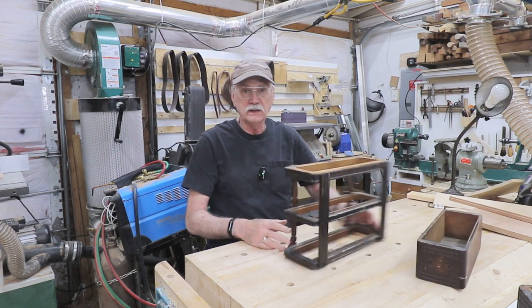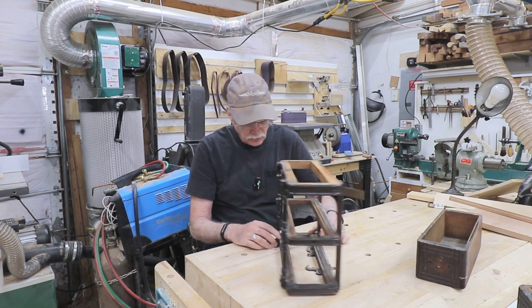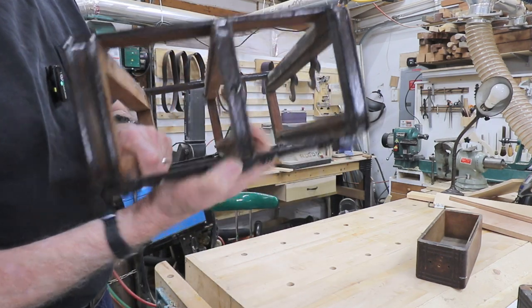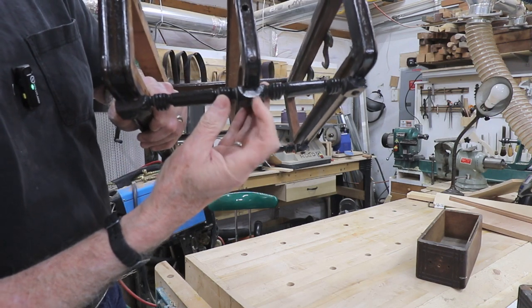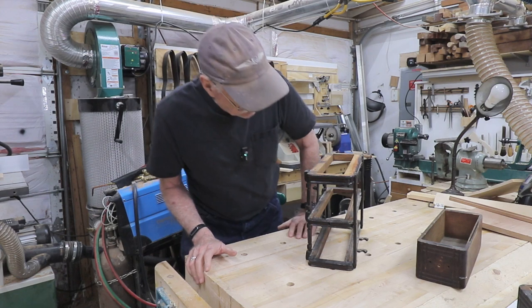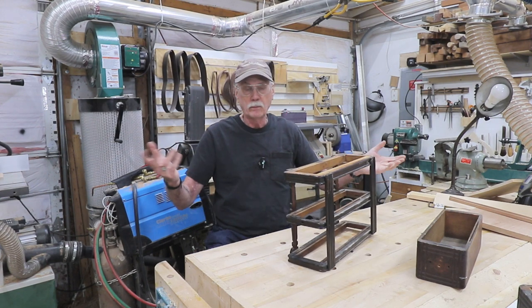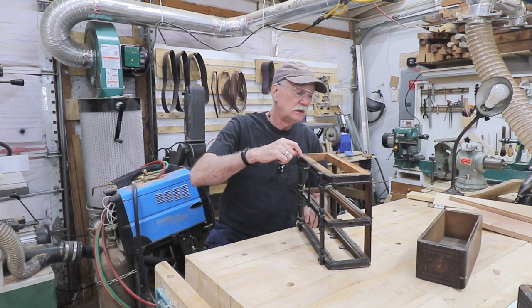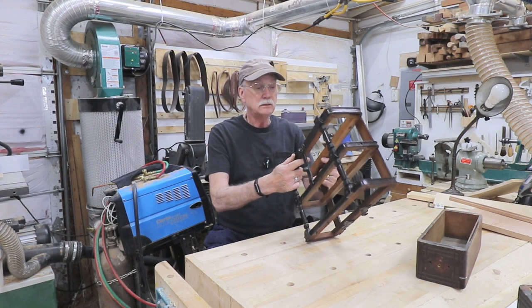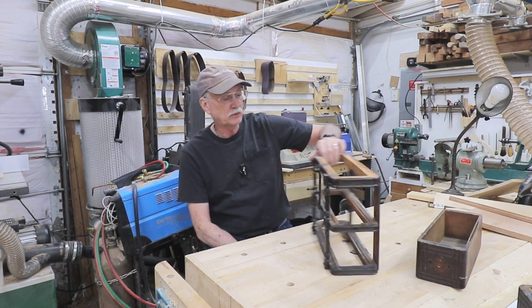The support for the leaf is this little hinge bracket here, also missing a screw — missing a lot of little bits. This piece is inlet, with two shoulders inlet in here so it's got to line up. I'll ask Mara how deep she wants me to go into building one of these — it's not a showpiece, not a valuable antique, it just needs to be turned into something nice. Oh, I found another joint here — that's just a broken piece where it checked along the grain. It's got some pretty nice straight grain. So that's what I have to build and make it work.